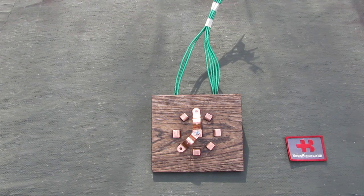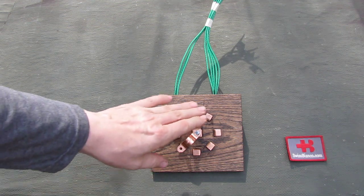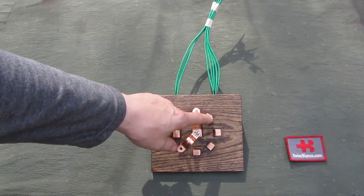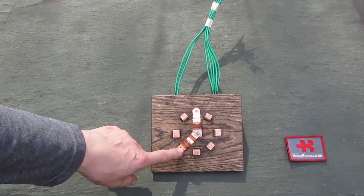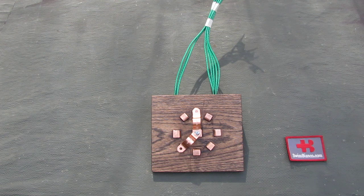Maybe you have one that follows a fence or something, so that gives you the possibility to switch the radio antennas really fast while leaving it on your favorite radio, so that you can test out what you get on the same frequency with one radio from multiple antennas. Which one is going to be best? That is uneasy to say. That depends on a lot of factors like the weather and how it is set up, so that you see in which direction it goes to have the best shortwave reception in your area.